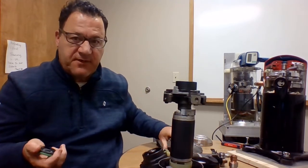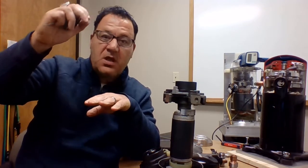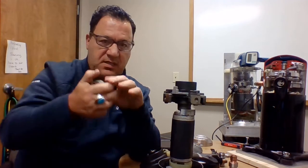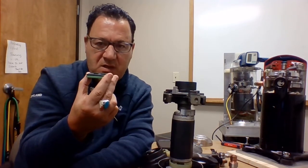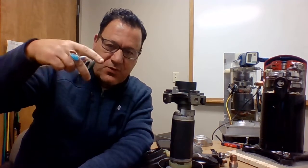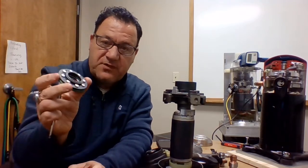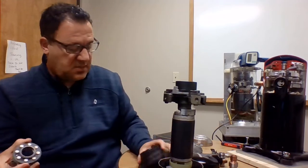Fun fact: if for some reason that compression ratio gets far apart, with low suction gas specifically, it doesn't have enough pressure inside that cell to hold that floating seal up or push that fixed scroll down. It will then drop, causing the compressor to shut off. So the floating seal is actually a safety device also.